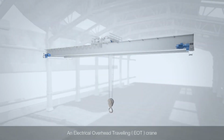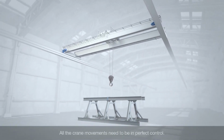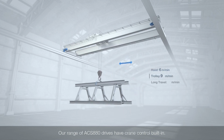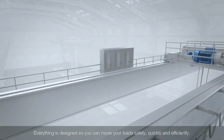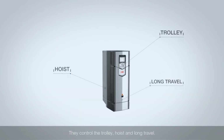A typical overhead traveling crane is commonly found doing this hard work. All the crane movements need to be in perfect control. Our range of ACS 880 drives have crane control built in. Everything is designed so you can move your load safely, quickly, and efficiently. They control the trolley, hoist, and long travel.